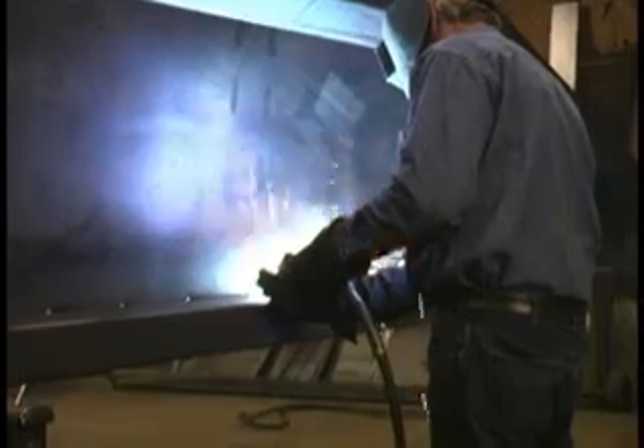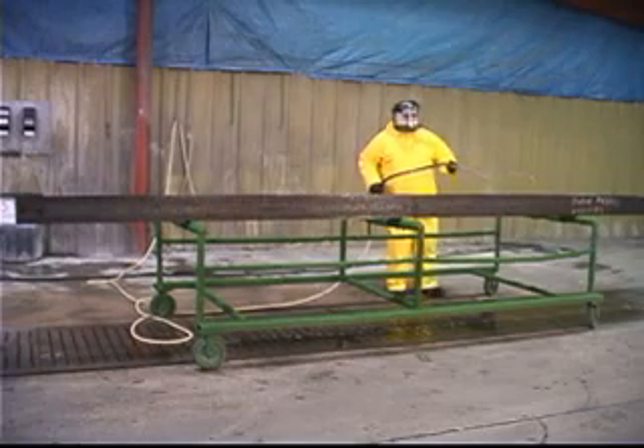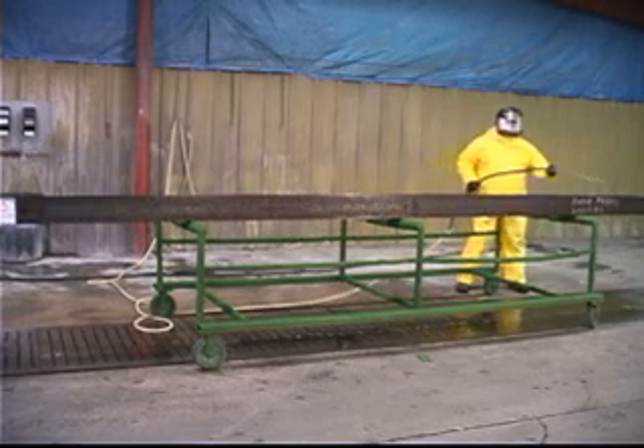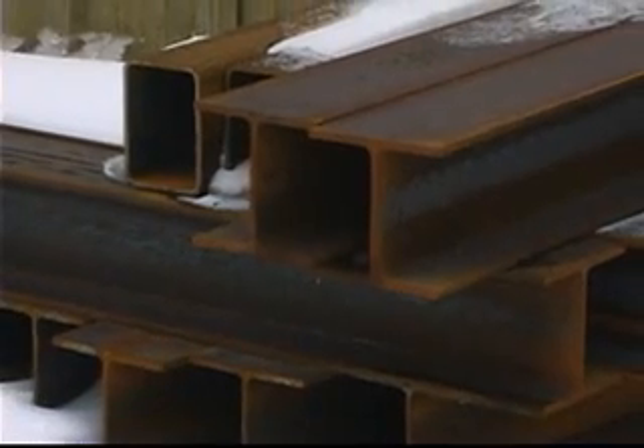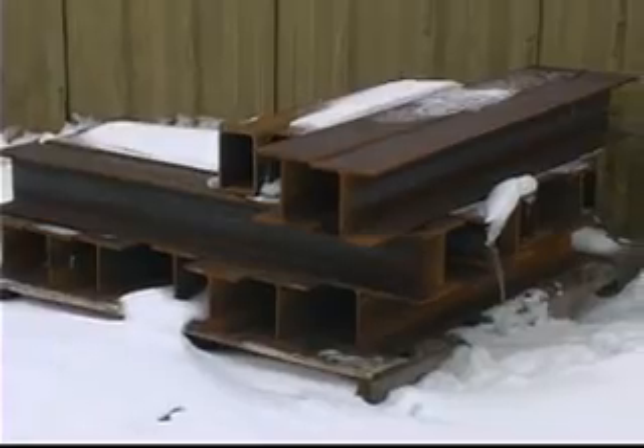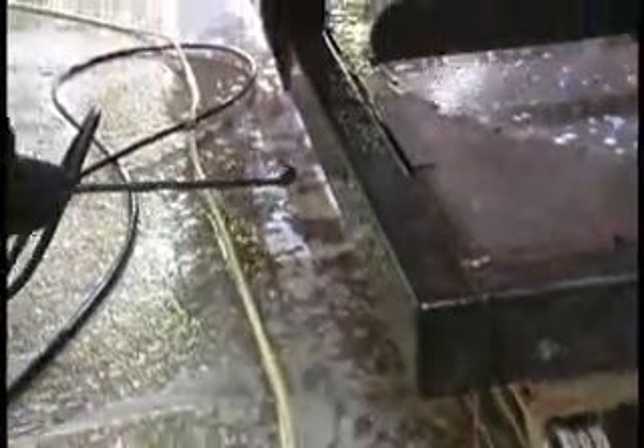To remove typical rust, mill scale, laser scale, and weld scale, the dwell time is approximately 2 to 10 minutes. This reduces hours of manual grinding or sandblasting to minutes, not to mention the labor cost savings. You can even apply Dew Gel 200, walk away and do something else while the product does the work. For extremely rusty, pitted surfaces, Dew Gel 200 can be left to dwell as long as necessary, and can be reapplied on parts with excessive rust or as needed to completely remove scale or rust.